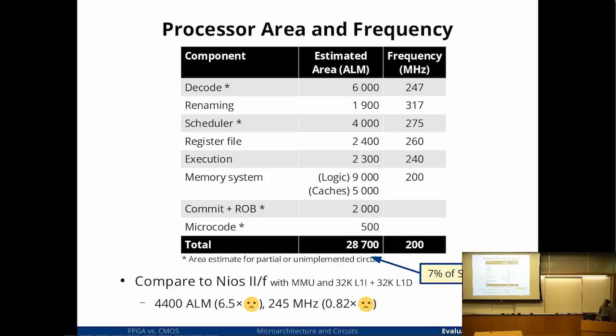There's also a bunch of microarchitecture decisions that won't work in x86 in 64-bit. For example, I tuned my front end to decode, say, up to 1 prefix byte, and assumed most instructions were about 3 or 4 bytes long, and 8 bytes and longer were very rare. But 64-bit adds more prefix bytes to the beginning, so I would have to redesign the decoder to handle 2 prefix bytes as a common case instead of a rare case. So there's a whole bunch of other things that you would have to change. But it would still fit easily on a current high-end Stratix. Yes, I think it would very easily fit.